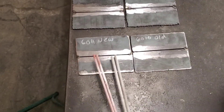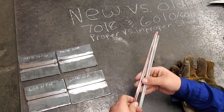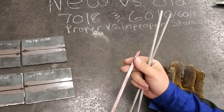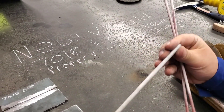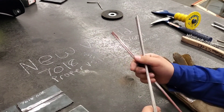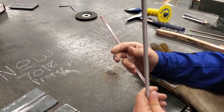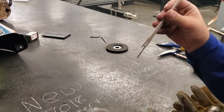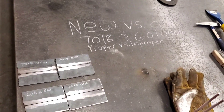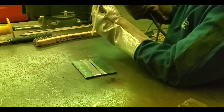We're going to run a new 6011 rod and an old 6010 rod. These rods are some farm-find rods - that old red 6010 has bad flux coating, basically chalked up with flux from other rods rubbed off on them. The old 7018 rods are in pretty decent shape but have not been baked in an oven - just sitting out in the open for probably 20 years or more. I've sanded the terminal ends off all these rods, and to make it fair, did the same with the new rods. First we'll run the new 7018 - this was cooked in an oven, no moisture, stored in the oven for the past couple of days.